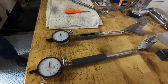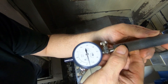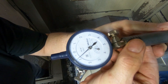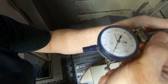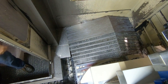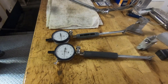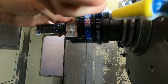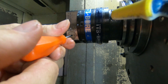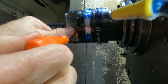After measuring the bore with the dial bore gauge, it's going to be about nine thousandths undersized, so I'm opening the boring head up eight thousandths more. I didn't show everything in between because it would look exactly the same in the video, so I just show the first and second adjustments and the last pass. Here I'm increasing the diameter by four thousandths, or one revolution on the boring head.